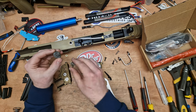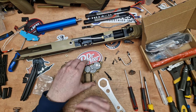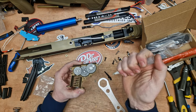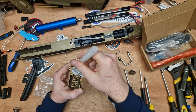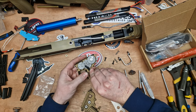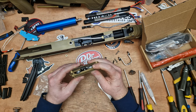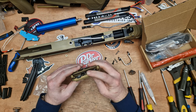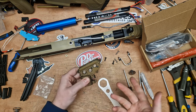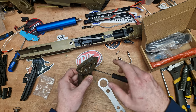Sorry Silverback, but I did pick that up on your video - it was awkward to watch. Not throwing any hate - I'm just saying there are easier ways to do this. You can just use the click function to apply just what we need and not over-apply it. Because I've modified this gear from the standard gear, it's going to work a little bit differently, so I'm going to pop it onto the shims I have installed and check the mesh. The mesh seems really good, so I'll apply some grease on the back side and pop the casing back on.